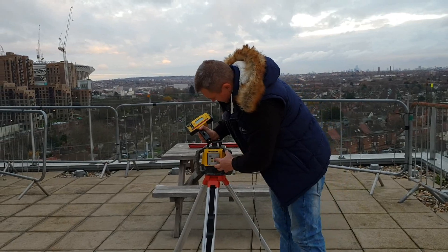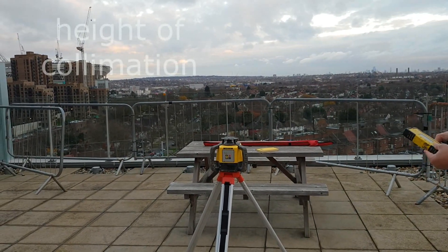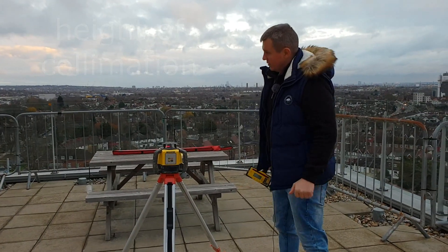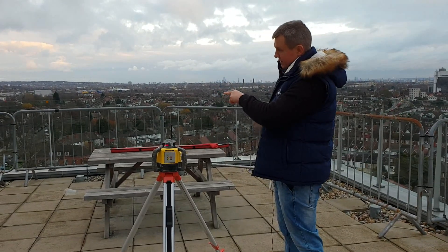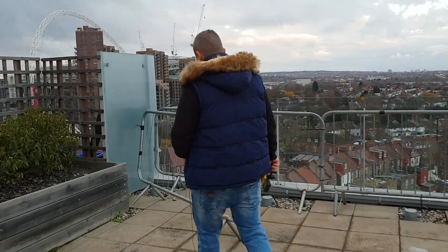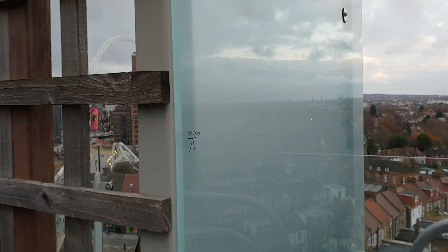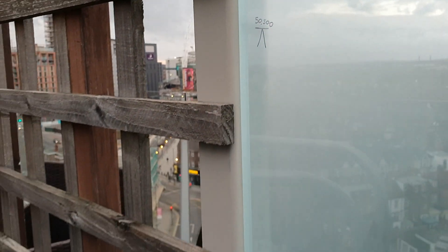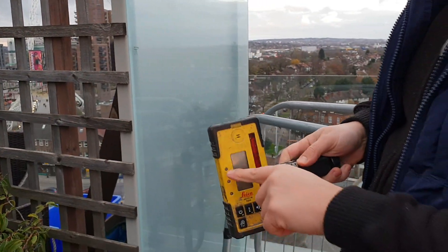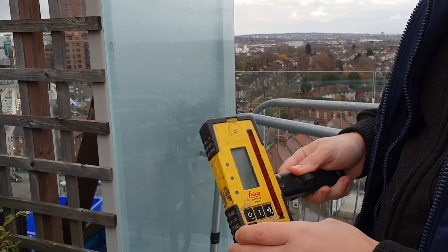Have a look, it's quite right — okay, turn on — and we will get the height of the laser in a minute. So now we have a datum here, we got a known height: 50.5 meters, you can see it here. Our laser is spinning somewhere below that, and to get this we're going to use a receiver now. That's the level of the receiver here; it's going to show us when we hit the level — you're going to see it in a minute.